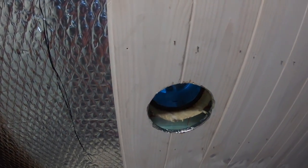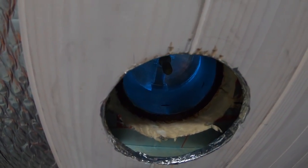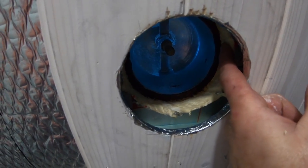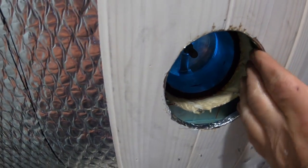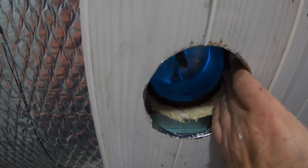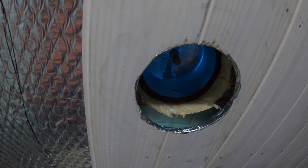So with this one, we've just got to forfeit the spray foam. Loads of Sikaflex into that. So there's a big thick bead on there, and then squeeze the duct in with a pipe straight onto that. Yeah. And then anything that oozes out, when it's all gone off, I can take the top off the mushroom and just trim it back with a Stanley from the outside.